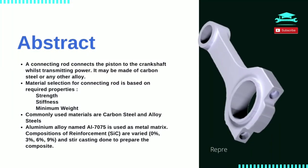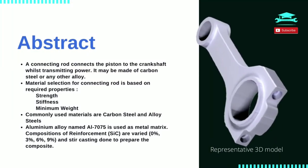To begin with, I would like to give a brief overview on what this paper discusses. As we do know, connecting rod is an intermediary member between the piston and the crankshaft. Its primary purpose being conversion of the high load reciprocating motion into rotary motion. Commonly, cast steel is the material selected for its production due to its high strength and stiffness, but cast steel being of higher specific gravity consumes more fuel. This study was done to find a suitable lightweight replacement material for the commonly used cast steel as a production material for connecting rod.